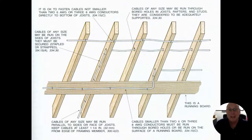But as far as non-metallic cable, just about everything that you're going to use outside the city of Chicago is pretty much going to be NMC. In fact, just to be really clear, other than New York, Chicago, and Los Angeles, everywhere else in the United States of America, and I'm talking about the city itself plus the surrounding burbs and the locale around the city, they all use non-metallic cable for residential buildings, right? Everything for commercial buildings has to be in conduit, but residential buildings, non-metallic cable is just fine.